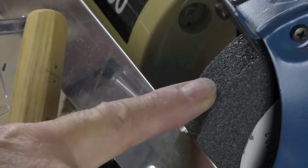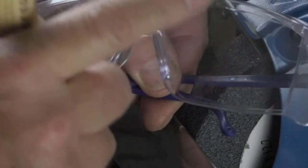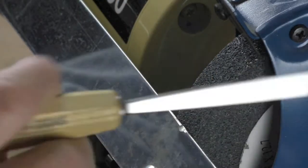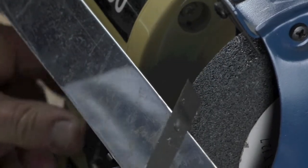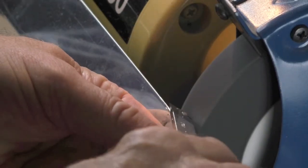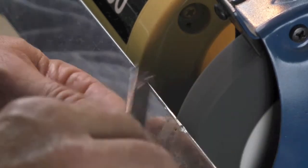To begin with, we're going to shape using the coarse grinding wheel. You'll need safety eye protection — you must have that — and you'll need water to dip the tool in to keep it cool. The first thing we need to do is round off all this lower corner. All this is going to come away. Use quite light pressure.